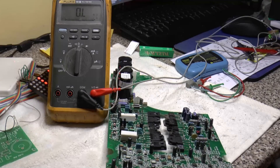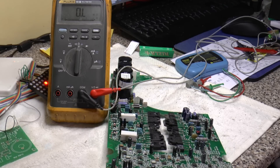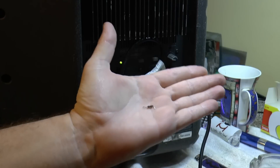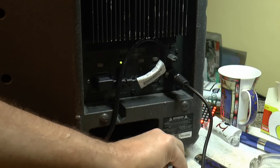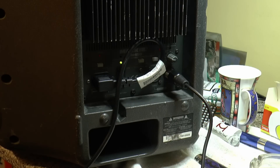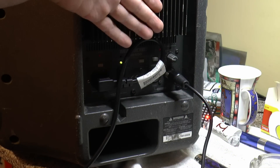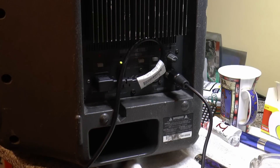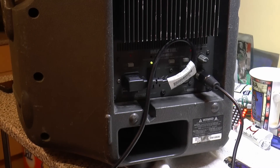Something in the circuit drew a little too much power and that resistor went open circuit. I'll change it - it's a 10-ohm resistor, probably half watt, and give it a try. One 10-ohm, 4-pence resistor later - that was it. The 10-ohm resistor next to the 15-volt regulator - job done. No more protection light, power light is on. I've had music playing, but I can't play copyright-protected music on YouTube.